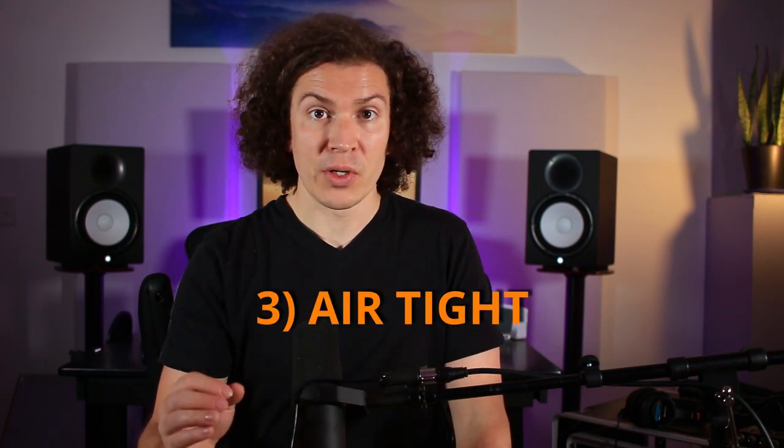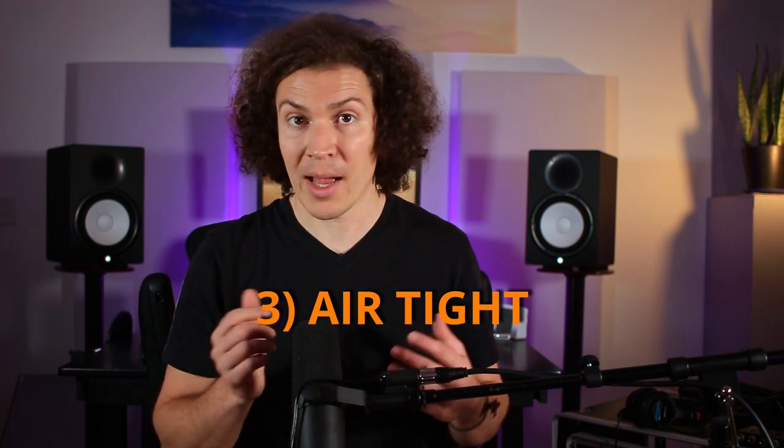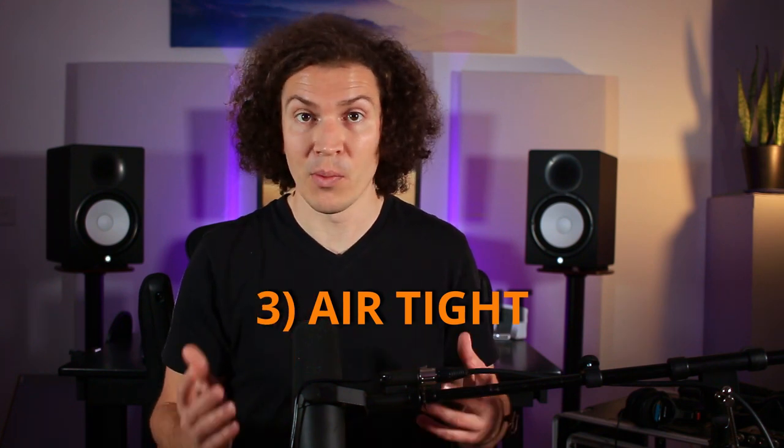Lastly, we want to make sure that your windows are airtight. I'm not planning on opening these windows — if you want to open your windows, that's a whole other can of worms. But regardless of whether your window opens or doesn't, you have to make sure there's no air coming through any cracks around your window. To do that, you have to seal it with acoustic caulk and whatever you can to make sure no air can come from the outside window through your air gap into the inside window and into your soundproof room.